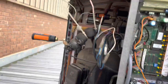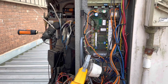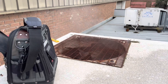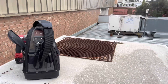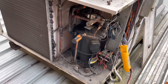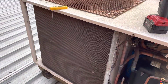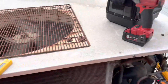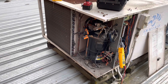I've got my probes on. Currently it's running in heating, but to replicate what happened yesterday I'm going to flick it over to cooling. This thing's been running for about five minutes now — got a 24-degree condensing temp. It's 15.3 degrees outside at the moment. Looks pretty good, we'll keep monitoring.